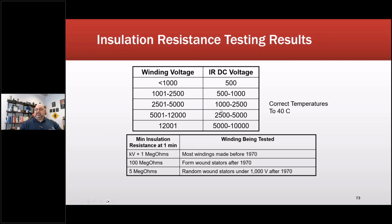So things to consider. But voltage, on the other hand, even if I've got a 480 volt motor and I go in there and I use 2500 volts, the only thing it's going to do is my reading will read lower. So the purpose here is to make sure that I have a voltage that's consistent when I test between. The other thing to remember is using two different instruments, I can get two different answers.